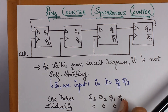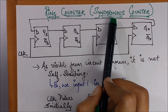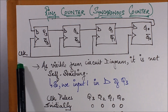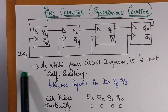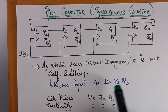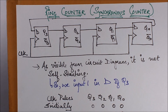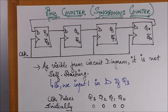The output of the last flip-flop is attached as the input to the first flip-flop, forming a ring. Another important thing is that this is not a ripple counter — this is a ring counter because of the ring being formed. Also, this is a synchronous counter, which means all the flip-flops are synced with a single clock. They are not getting the clock pulse from their preceding flip-flops as was the case in ripple counters; all flip-flops are triggered together with a single clock.